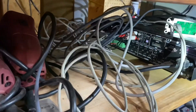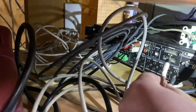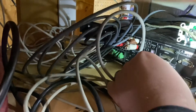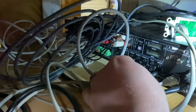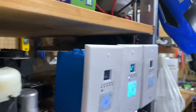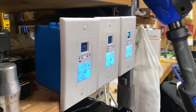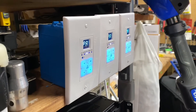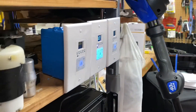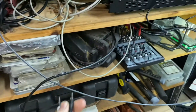I'm going to rig a way for us to have a switch that's going to end up muting it. We have the control out — I'm going to plug part of this 1/8-inch cable into it so it continuously has 12 volts coming out of it. Then when I plug into PA, it puts every zone on — we have three zones here, one in another building, one in another building, and one in another. We can make the announcement, and as soon as you pull this back out it goes off PA.